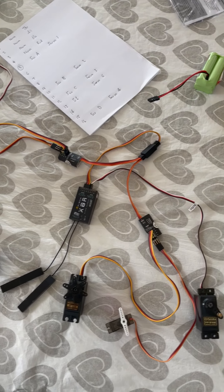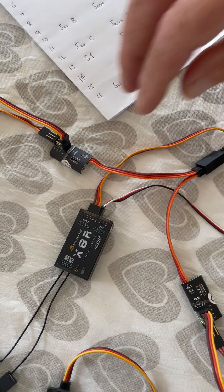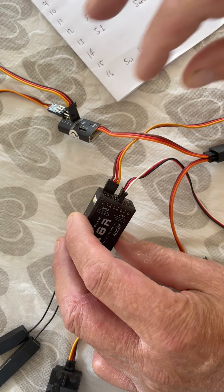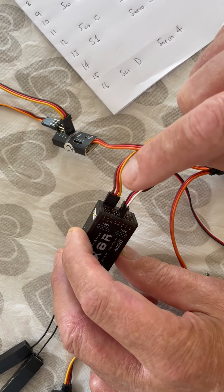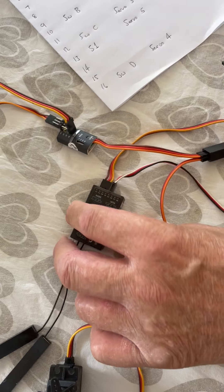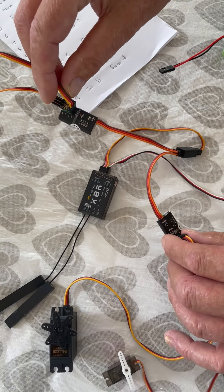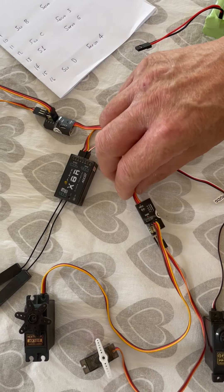I decided in the end to use one X8R receiver from FrSky. I'm only using one of the eight channels on the receiver because this receiver is capable of doing 16 channels on its own. This cable here is an S-Bus — they call it the S-Bus. This can carry 16 channels on its own, but I'm choosing to use the eight channels on the receiver and only eight channels from S-Bus. On the S-Bus you'll see that I'm connected down the wire to a Y-section, a Y-wire, which then goes to two S-Bus decoders. These change the signal from S-Bus into the PWM signal that we need.